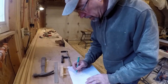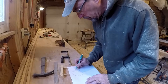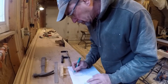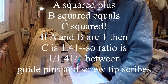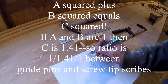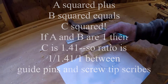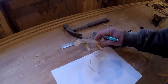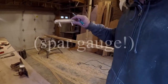The key to this thing is: if you want an octagon where each of the faces is equal, it's a simple trigonometry problem — use Pythagoras to determine that distance. And it's going to be the right ratio even as this thing slides down onto a narrower spar. That's the idea — forget the name of it.